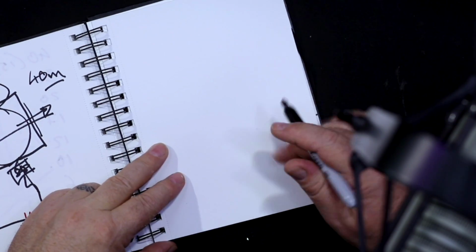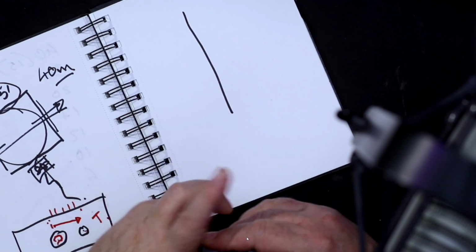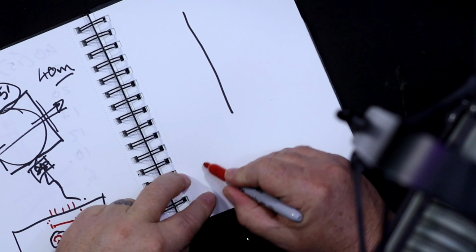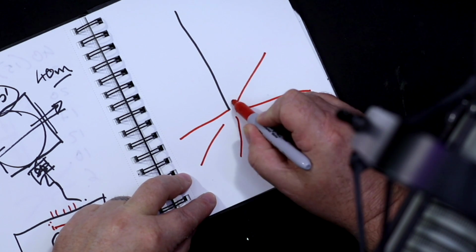Okay, but before we go, let's just cover something on radials. So ground radials. And I'm not talking about an earth spike, which is great for lightning protection, but won't really do anything for your RF. A fellow called Rudy Severns, he's an American, I think. He's done a number of experiments. And the experiment that I haven't yet done, but I'd like to, is he took quarter wave radials, all the same size, and he did 1, 4, 8, 16, all that sort of stuff. It must have taken him days, actually.